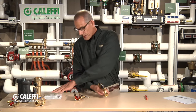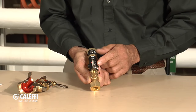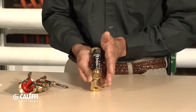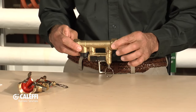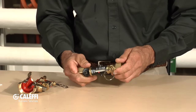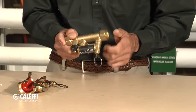So this is what it looks like when you take it out. These come in every one of our boxes — please read the directions because you'll learn a lot about this valve in just a couple minutes. This is our smallest version, the half-inch. It goes from half GPM all the way up to 1.75 GPM. There's a flow arrow on it, so the flow has to go through the valve in that direction. It can be mounted in different orientations — this way, completely upside down, or so you can see it from below. On a solar array, you'd want to protect it from sunlight since this isn't UV plastic, and protect it from freezing.